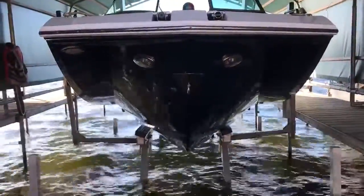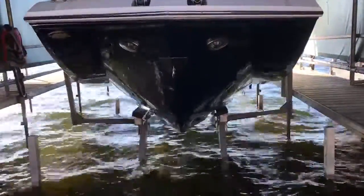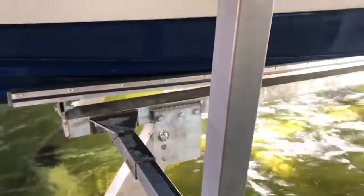Here's a front shot of the 2012 Regal Boats 24 Fast Deck with the Fast Track hull design. One thing you can notice on our lifts is that we have adjustments, so the bunk adjustment can be raised or lowered. If the lift settles, you don't have to have a barge come back and reset the lift each and every time. A lot of times what happens is it'll settle just a little bit with the weight of the boat, so you can raise or lower one side fore and aft to get back to a level surface.